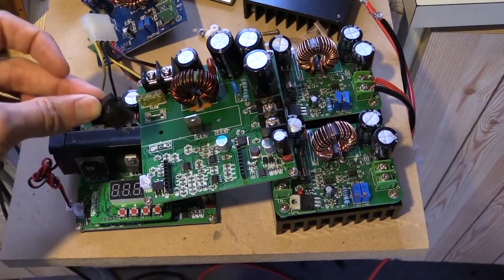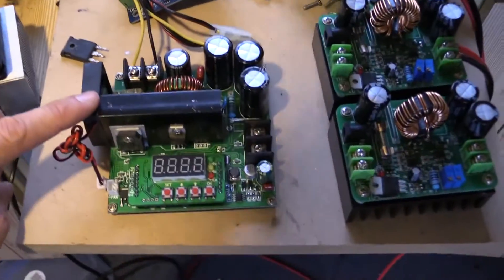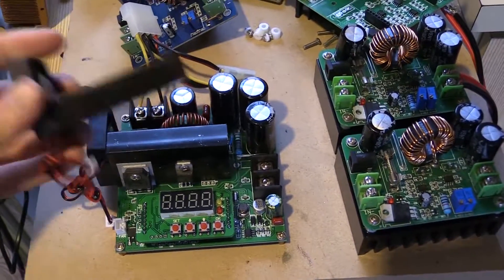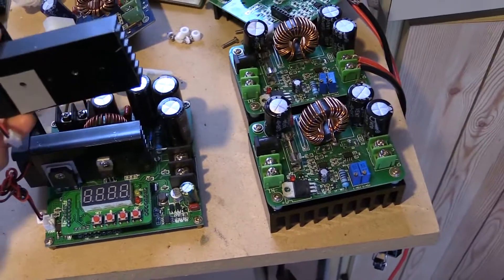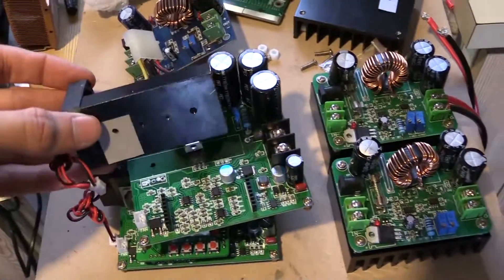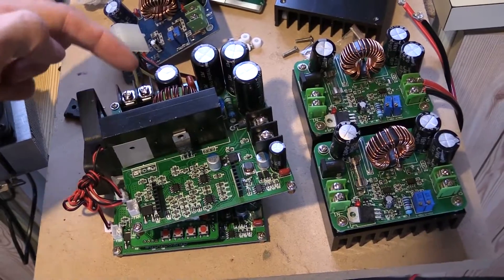The problem with this whole unit is the cooling. Looking at the new one — I just got this the other day and tested it — they've got the power MOSFET with the diode connected up to this very thin heatsink, and this is the heatsink off the other unit. As you can see, it's tiny. Why this one blew up was mainly because it just got too hot and popped. I was pulling about 13 amps off it and it died — though I can't remember whether that was 13 amps on the input or the output.